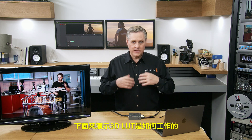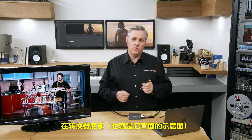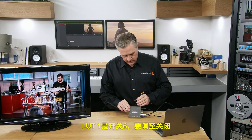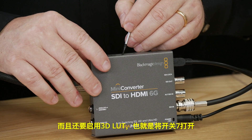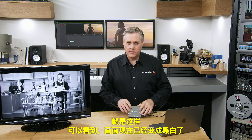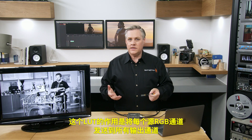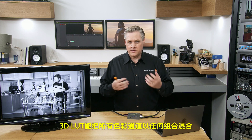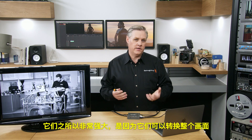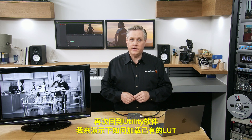I'll show you how the 3D LUT works. I'll enable LUT1 on the switches. The labeling is on the bottom — LUT1 is switch 6 off. I also need to enable the 3D LUT, which is switch 7 on. The pictures should have gone black and white. That means I've got a black and white 3D LUT loaded. This LUT sends each source RGB channel to all output channels — 3D LUTs can mix all color channels in any combination, which is why they're so powerful as a full image transform. You can load any LUT you like via the USB connection.